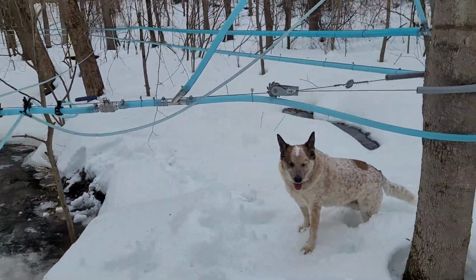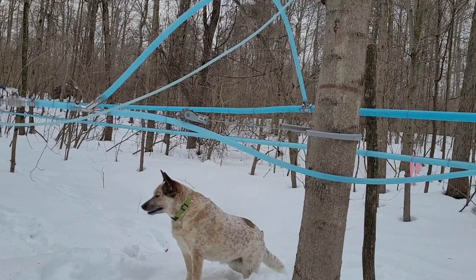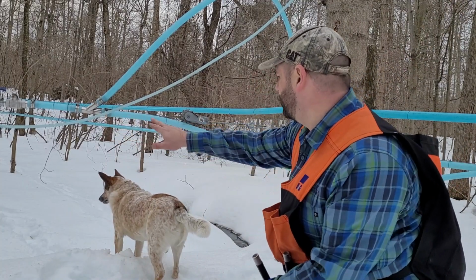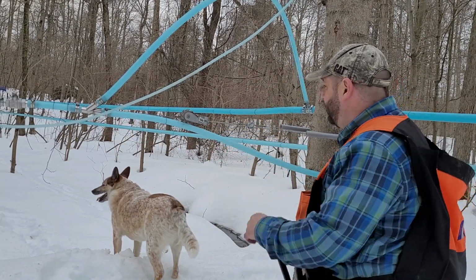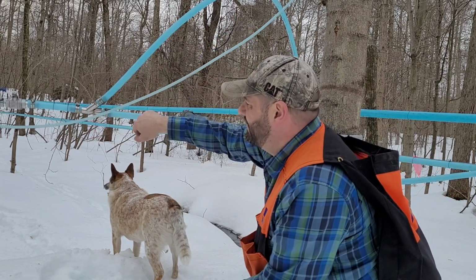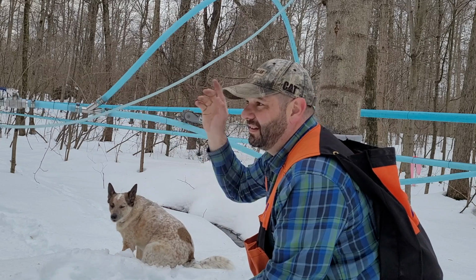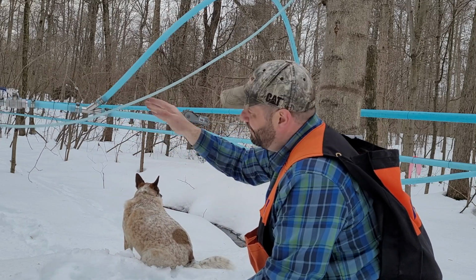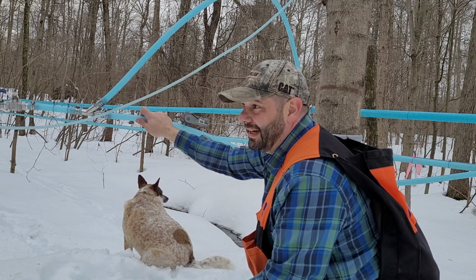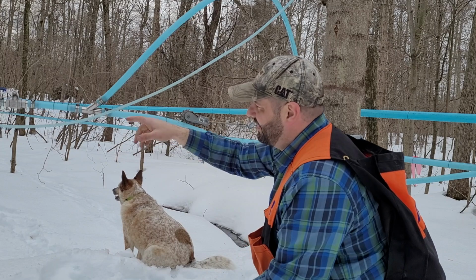This is a whip. Let me explain how a whip works. I've done it in previous episodes, but all right. This is where the liquid drops down into the wet line on our wet dry line. This is where the vacuum comes from on our dry line. This little valve right here is the secret. Because if I open and close that valve, if I hear sound, I know the leak is on this line. If I don't hear any sound, I move on to the next one. So this is a way when things start getting tight, or you need to find a vacuum leak in a section of woods, that valve is your friend.